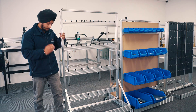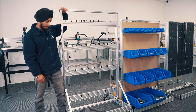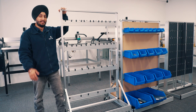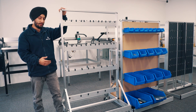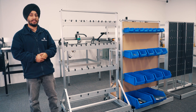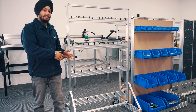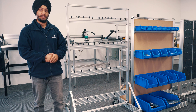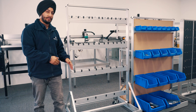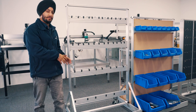The frame is done, the brackets have been installed, and the cross bracings have been installed. If you now apply force at the top part of the frame, you can see it's not wiggling — that essentially solves our issue. That's how you can create your own products using CNC machines, going through the whole design process. The possibilities are endless; it's just your imagination that limits you. The frame has been designed to hold our totes which showcase our products, and that's why it has been reinforced with these brackets and cross bracings, as sometimes the totes can get a bit heavy.